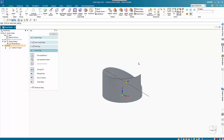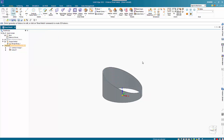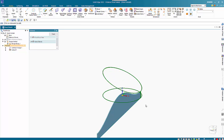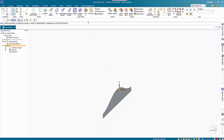I want to clear away on the top side. This is through all, so I'm going to take it through in both directions. Now I want to create some cuts, but before I can do that I need to unbend it. So you pick your edge and your bend — the main cylinder actually becomes the bend.